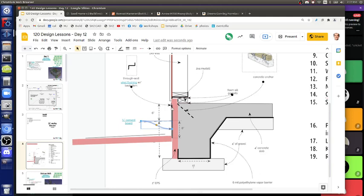So what we do is place it about even with the foundation level and stick it down into the ground a little bit. We might have to dig a little. The foundation there is kind of uneven, so it's somewhat exposed, but we might have to dig a couple of inches or just poke the cement board down, possibly dig a little bit with a heavy hoe. We just need access so we can slip it next to the foundation. The pieces are 12 inches, so in places we have to go down as deep as 6 inches more.